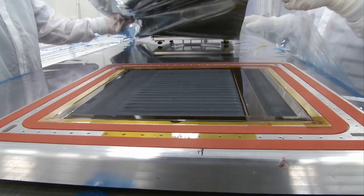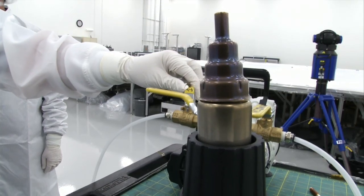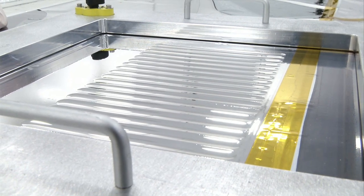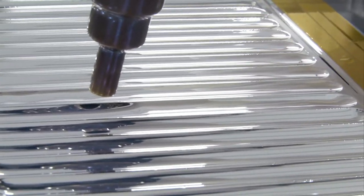So, what do we have here? They're going to place the material on top of the compliant border tool so that we can form a vacuum. It's actually suctioning it? Yeah, it puts a vacuum onto the film and pulls it down into the shape that we're trying to achieve. This is one of the slowest processes we have. It takes almost 12 days to do this.